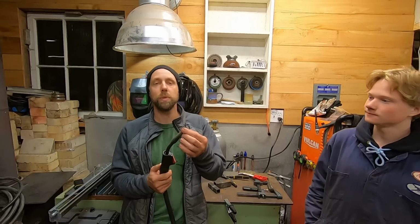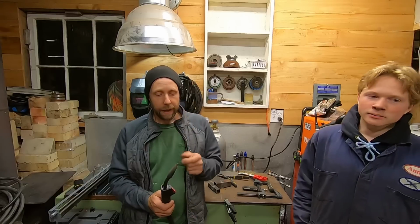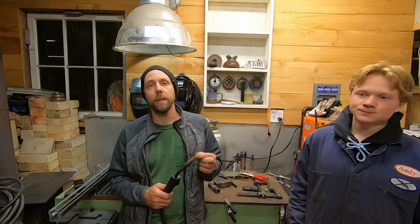And another thing to consider, if you've been welding for a while with the same tip, especially with flux, because flux is pretty dirty. MIG is a lot cleaner. You don't have to change out tips as often, but you want to change these little consumable tips up in the front every so often. You know, maybe every time you put a new roll on your welder, like that's I think a 1 pound roll or 2 pound roll. You want to switch those out maybe every time. They're not very expensive, and it'll just make sure you get a good contacting tip on there.